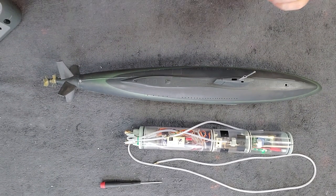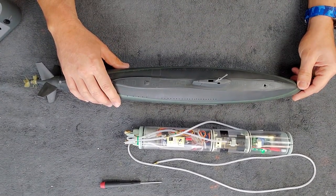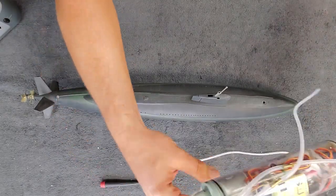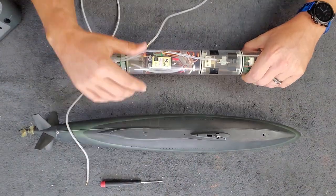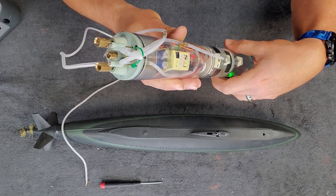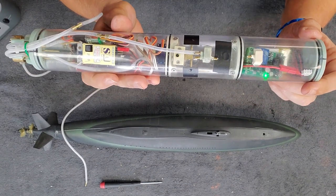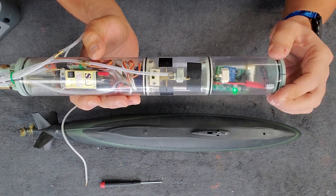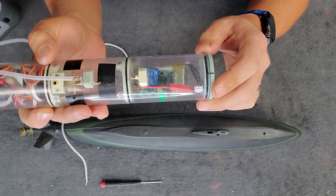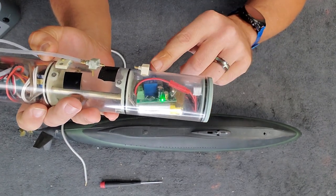This is the first opportunity we've had to try out our new mounting rig above the work table. Let's look at the watertight cylinder individually. This is a 2-inch outside diameter twin-shaft watertight cylinder put out by David Merriman, formerly marketed through Nautilus Drydocks. Unfortunately it's out of production, so it's a rare bird. Starting at the battery compartment, there's a little green light inside — that's the remote on/off switch module — and a 2S lithium polymer battery pack.